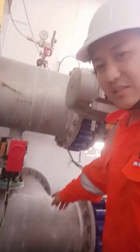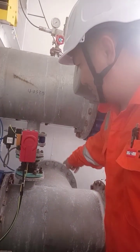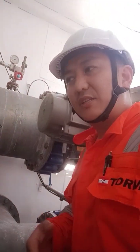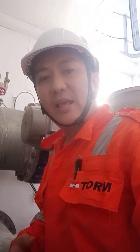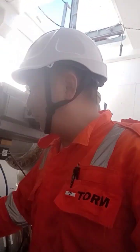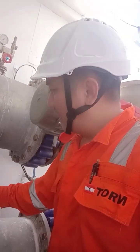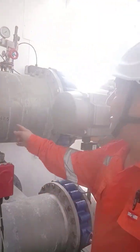First of all, this is where the suction of your ballast water comes from. There will be a sub-process first — it's a start-up phase of about one and a half minutes, or 90 seconds. During the sub-process, the water will come here and this valve will open. This valve is 40335, and there will be a pressure gauge along the line.